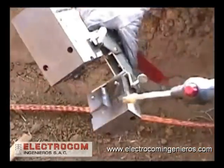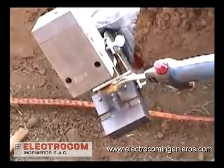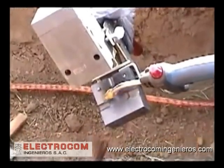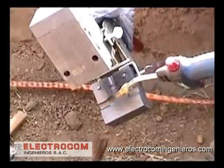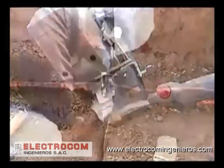It is important that there be no dirt, mud, or moisture on or in the cable, or moisture inside the mold, as moisture can cause steam and make the connection porous. The heat from a propane torch evaporates moisture from the cable and mold and assures a solid molecular weld. It is only necessary to heat the mold for the first weld of the day.